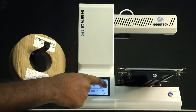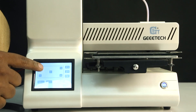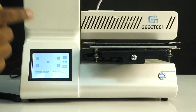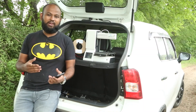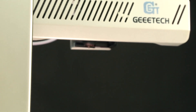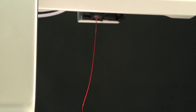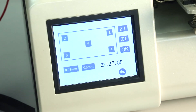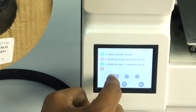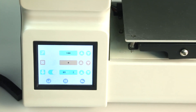It's loaded with features. There's an auto leveling function and a manual one too. You can move the hotend to different positions and raise the Z height by setting it in the touchscreen, and the software actually remembers it. There's also filament in and out functionality — we know how difficult it is to hold the extruder and push the filament through, but here you can just tap the buttons and it extrudes the filament. All this is done through a really colorful TFT screen with amazing touch sensitivity. You can raise and lower the temperature of the hotend by just tapping the buttons.